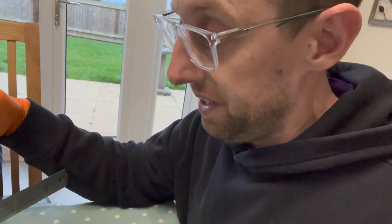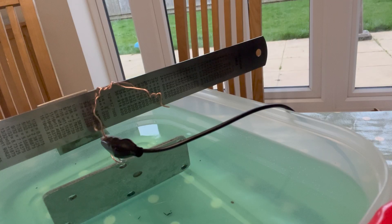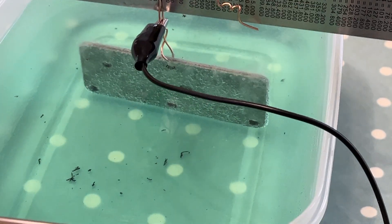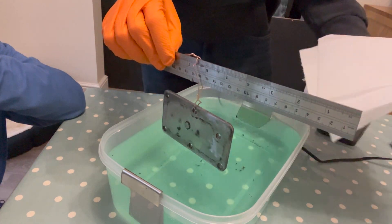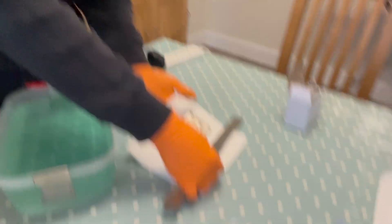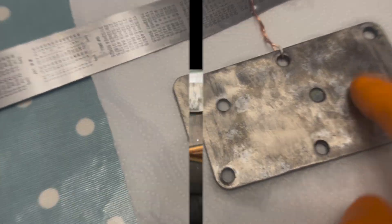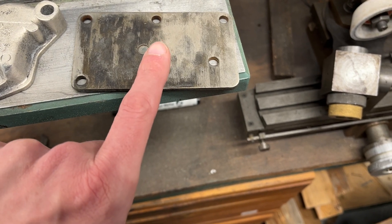Okay, so what you now actually have to do is put a negative feed onto the actual wire which is holding the piece that you want plated. Now you can see the piece that we actually want nickel plated - it's gone all bubbly. Turn off that, like that. We were right - it actually took three lots of 15 minutes, so 45 minutes worth of going through the actual plating process.